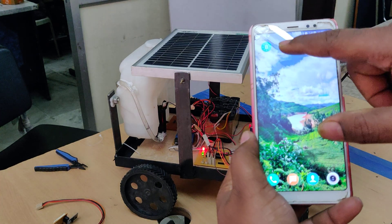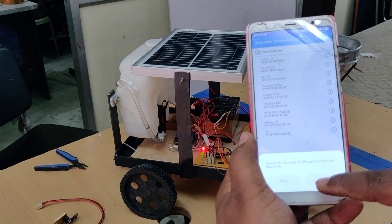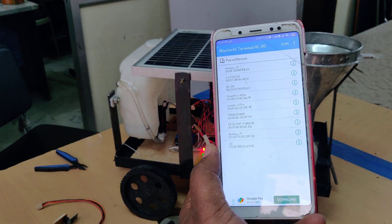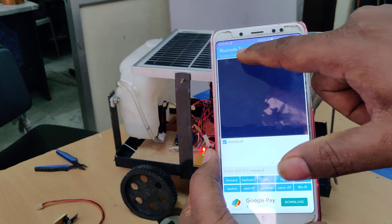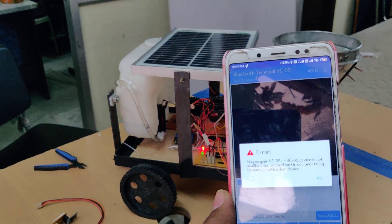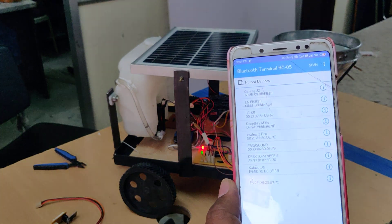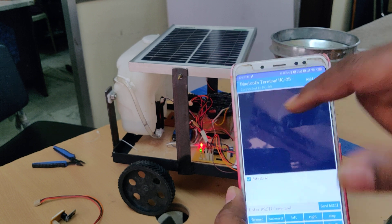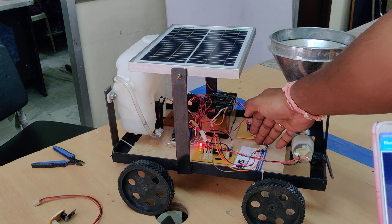After the one-time setup from settings, go to our Bluetooth application and tap Scan. You can see HC-05 is already paired. After successfully connecting, the device will appear as connected. You can see the blinking on the module slows down after pairing from our application.